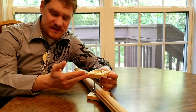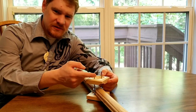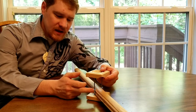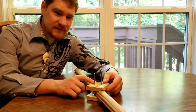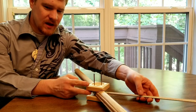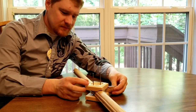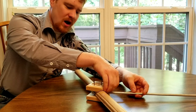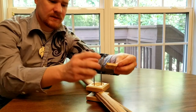Now that we're finished shaping these hinge pieces, we can go ahead and assemble them on the staff like they'll be when it's finished. I've used some extra pieces of steel rod in this case — when I'm done, I'll replace them with brass, but these will stand in fine for now. Use your washers to space apart the slats and keep them from rotating in the final design. There's one more thing we need to finish these hinges: as you can see, there's an open space here which will allow the wings to open indefinitely. We want to stop it a little bit earlier than that, so I'll make side pieces like this — they'll fit right inside there and block that wing right as it gets to 90 degrees.